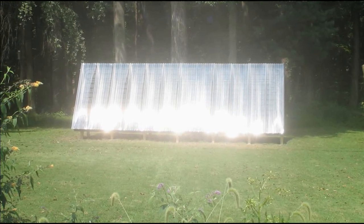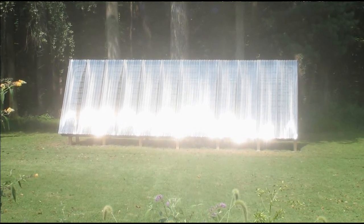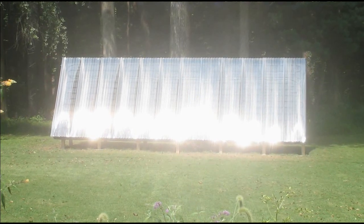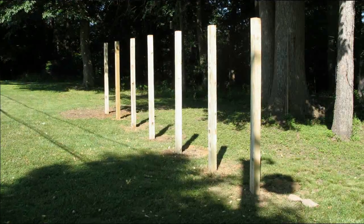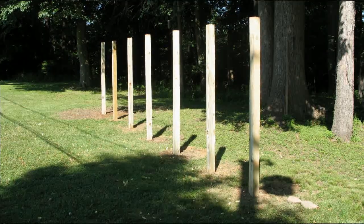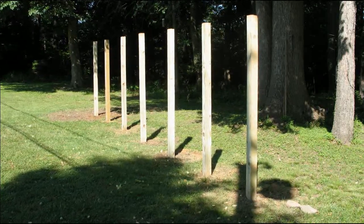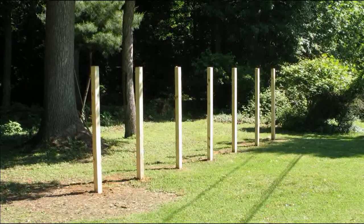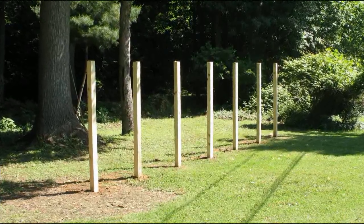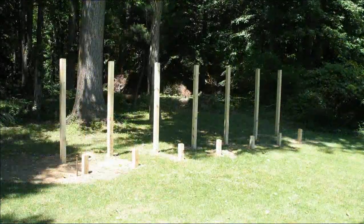But that was really good exercise. I'm really pleased with my placement decision and everything about this project, which turned out to be a huge amount of fun to build and an activity that the whole family enjoyed. Here's a step-by-step pictorial of our build process. We begin by setting the back posts for the panel. They are eight-foot 4x4s of pressure-treated lumber set two feet into the ground. Initially, we just dug the holes with a post hole digger, put them in, and packed the dirt back around. But after giving that some thought, I did go back later and dug around them and put some concrete around each post just to give it that extra level of stability.